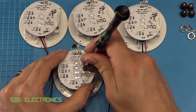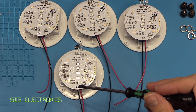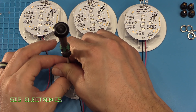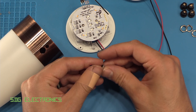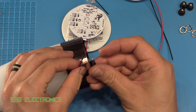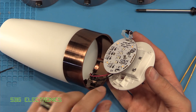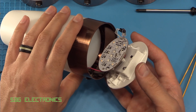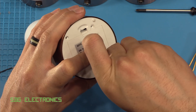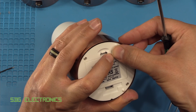With those components in place, we can just screw all of these PCBs into place, reusing the previous screws that came with the units. Before we put the lids on, we need to connect up the DC jack — making sure we've got the nut on first. It's worth leaving the wires a little bit longer than needed so you can still reach the programming header without removing the DC jack. Then everything just slides in, and we can put the two long screws back into the bottom of the unit, plus the little stubby screw to hold the battery compartment closed.